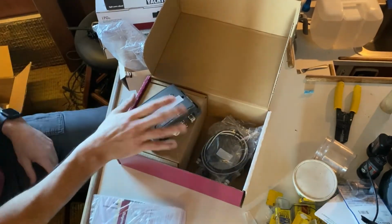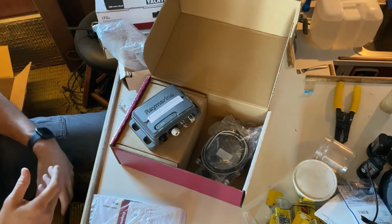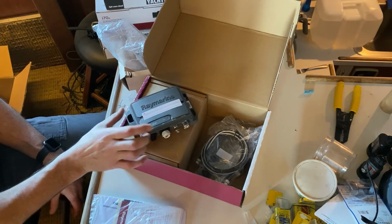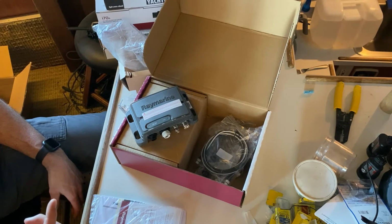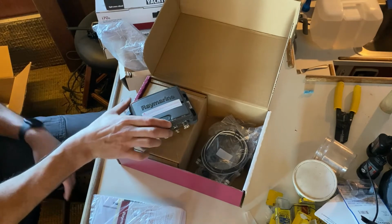Like I said, the reason why we spent the extra money on the 650 is because it's so important when you're transiting large bodies of water, especially if you happen to be out at nighttime, or in particular in fog or some kind of storm, to be able to see what's around you. And while radar gives you a good picture, this, for all AIS transmitting vessels, will not only show us what is around us, but how fast they're traveling, how long they are, what they're carrying, and to some degree, if they filed it, where they're going. And we also wanted to be able to transmit out our position and our size and our direction, so that other folks are aware of us as well. So to me, it's a critical safety piece, and it was well worth the extra money to get it.